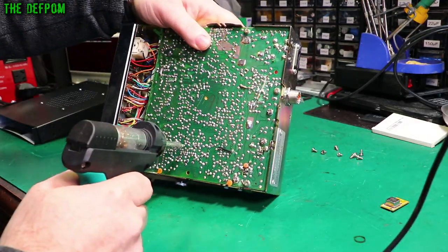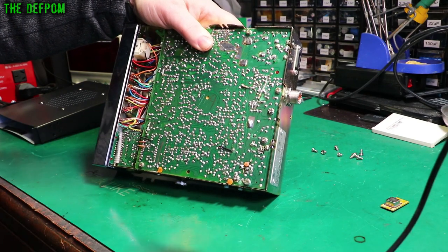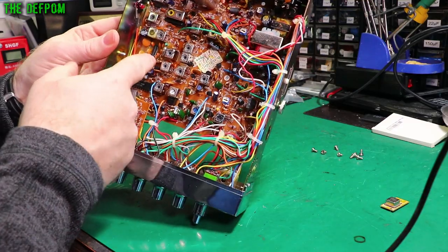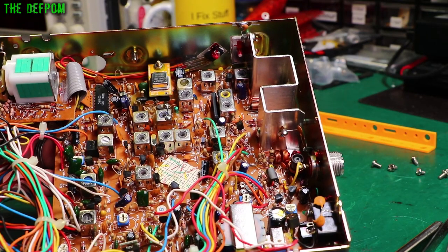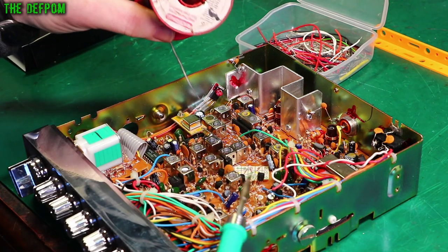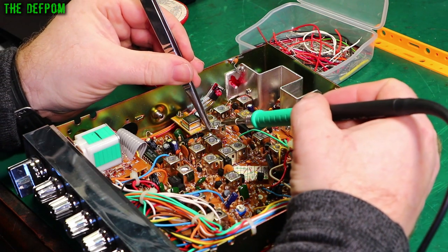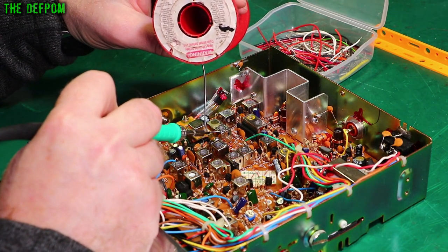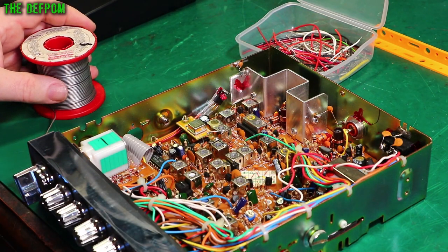So it's the capacitor that feeds the 15 MHz signal which needs to be desoldered. I should be able to lift that capacitor up once I can identify which one it is in this mess here — I always forget which one it is, it's a bit hard to find. There's the board mounted up in place. Now let's put the wiring in. I'll attach this wire to this can here — I've already scraped it up so I've got a decent solder connection. Just get some solder on it, flow that on there, get the wire spun around and into place, and attach it to the board. That's all secured.